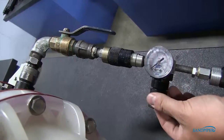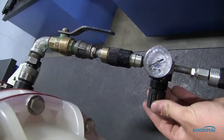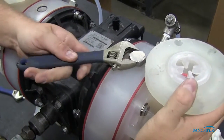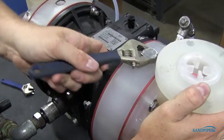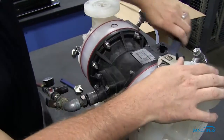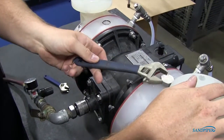Adjust the airline regulator so that the air pressure slowly fills the pump. The diaphragm expands, forcing the fluid in the chamber to be slowly displaced. Loosen the top BOSS plug on the filled chamber. This allows fluid in the chamber to purge trapped air, which can be seen by watching the column of fluid in the sight tube.